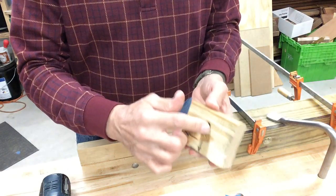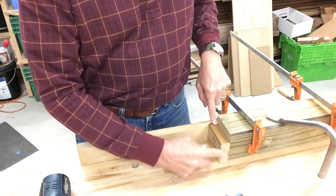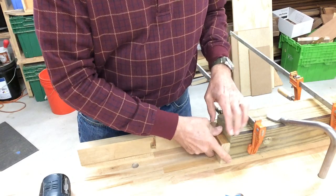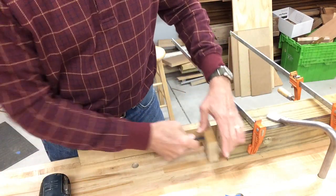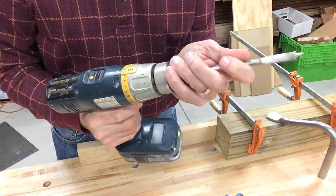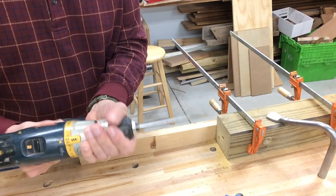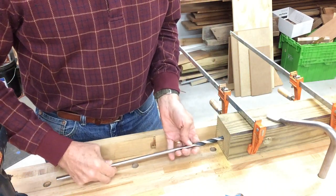I took a block of wood and I laid out a hole here, which I'm going to use to determine where that hole's going to be — laid it out halfway and halfway here, but whatever your location demands. The key thing is the hole I have here is 3/8, so it fits on this shank very nicely. I put it here to locate my hole. This is a transfer punch, but you could use a brad point bit 3/8, or just a little tap there would work too. So that locates where I want my hole to be. Now I'm going to take something with a point on it and start the hole from that locating point. I'm going to drill that maybe a 1/2 inch deep — same diameter as my installer bit. This bit cannot start its own hole; it needs to have some edge to go from.